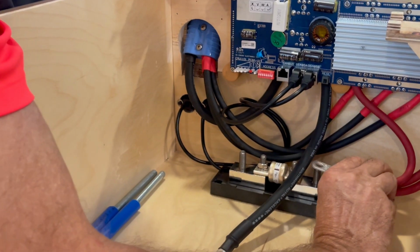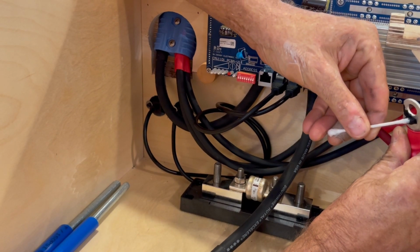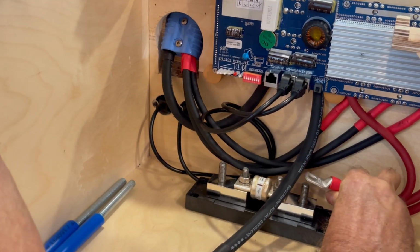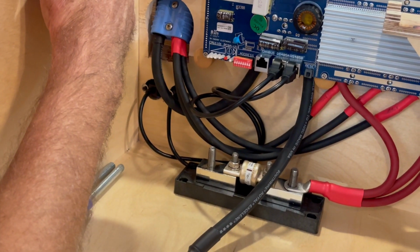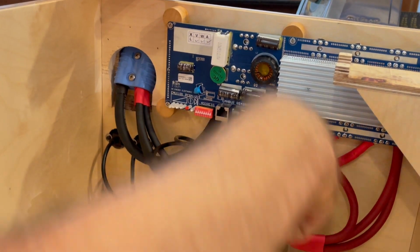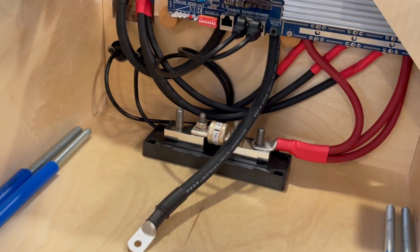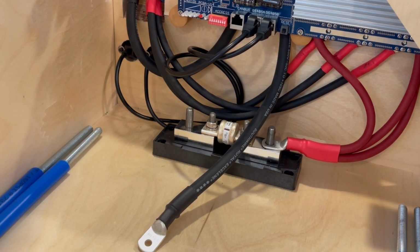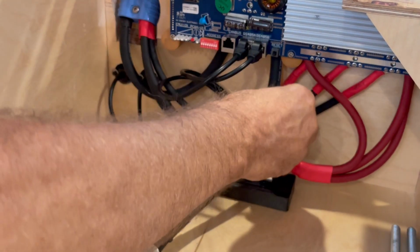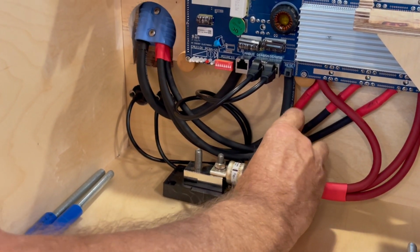And you see how, if you're careful about how the lugs get installed, they just lay in very nicely and you don't have to fight them later to try to get a twist out of the wire. It just lays in perfectly. And when I built these, I also built with the natural curve of the wire as it came off the coil, so it already had some memory. And so it kept that natural curve every place that I needed to go. And that's really important because you could really be fighting this and it would put a lot of strain on the PCB, and that's definitely not something you want.